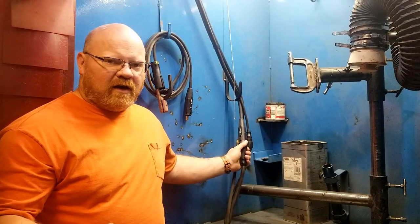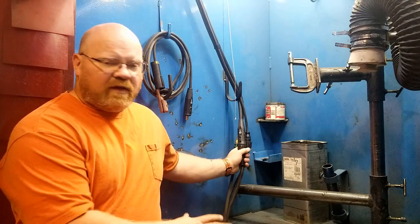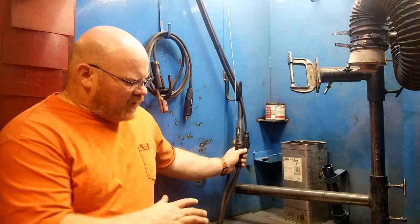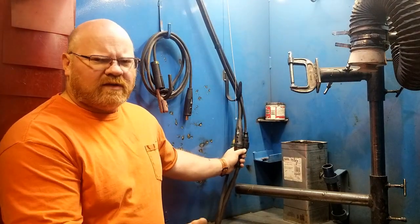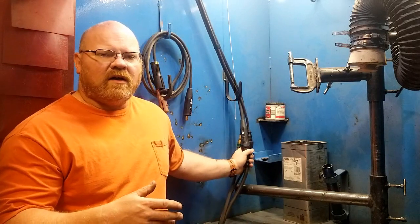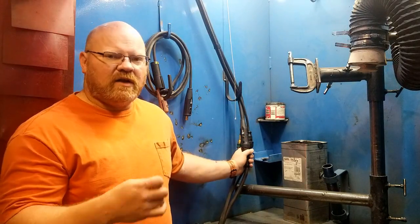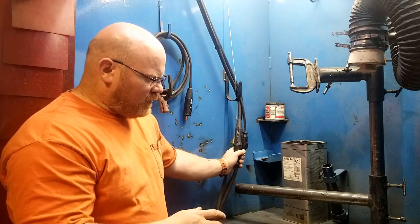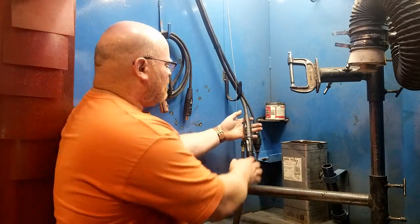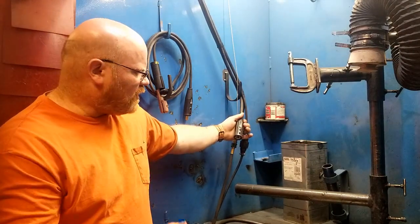This isn't intended to be complicated at all. But when we switch over our power from MIG, wire feed, flux core, to stick, we want to disconnect the feeder first. If the MIG gun was hooked up, there's always a possibility that the MIG gun has got the trigger pulled, or the gooseneck has got some spatter on it and it's electrically connected. When we flip the power on, we can arc something out — so we don't want to do that. We're going to make sure that the power is off. This is the main power cable for the welding current. We're going to simply unhook that — it's about a quarter of a turn, and then you pull that connector out.